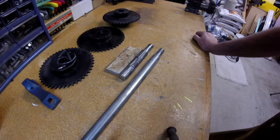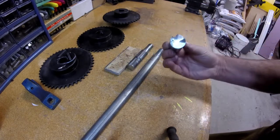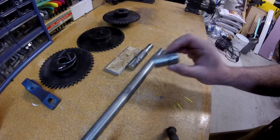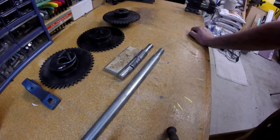When you're driving around on locomotive wheels and you make a sharp left-hand turn across the downhill slope at a reasonable speed, you do this to a one-inch axle. This certainly is not very good alloy — it is not 4140. It's probably 1018 or maybe even less than that. This axle probably did come out of China. But suffice to say, there were a lot of loads there, and that's something we'll have to consider in the future.